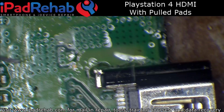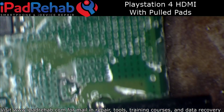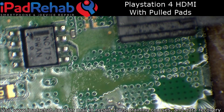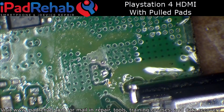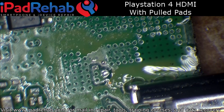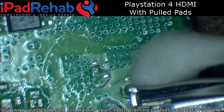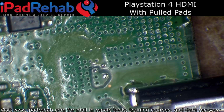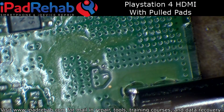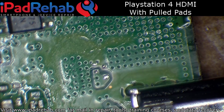Now there's a missing cap and a diode right there, which honestly I don't know what effect that will have on the video output. I would suspect, since they're both going to ground, that there may be some sort of protection and that the circuit will still work just fine, but I don't really know. And it's not my problem. I'm here to stick this HDMI port back on. I am going to clean off all this super sticky flux, though.